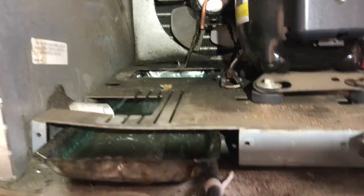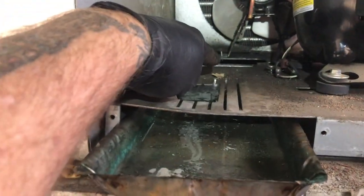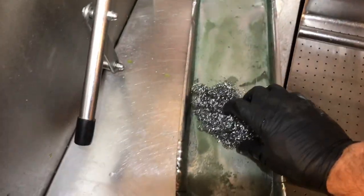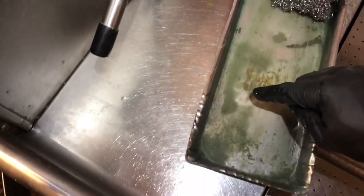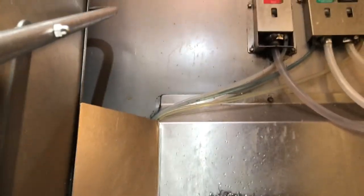A little tech tip: before you put your condensate loop back in, you want to pull your pan out. To get your pan out you've got to back off the two screws for your condenser fan motor. I'm not changing out that condenser fan motor because it feels fine. When you get that out of there, we're going to go wash this pan out to slow down the corrosion - since it's already got a bunch of copper patina in there, you want to get this cleaned up real good before you stick your new copper in there. I'm scrubbing on this thing and getting the clean out going - you want to try and get all this material out of there, and that will slow down the death of that thing.